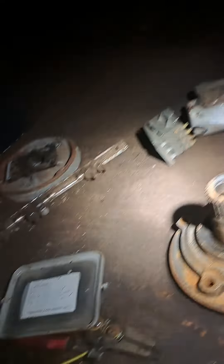I was a little nervous at first, but I will say this: if your shuttle shift is acting up, don't keep driving it. Shut it down immediately. Mine got stuck in forward, which means a broken clutch disc has jumped itself. Unfortunately, I kept driving it because I had to finish a job and I chewed up my pump splines. So don't be me. Don't do that.